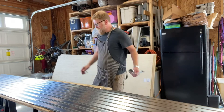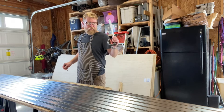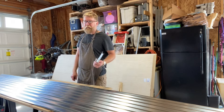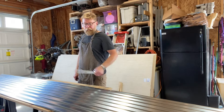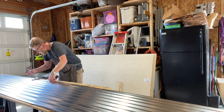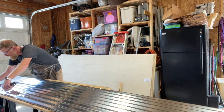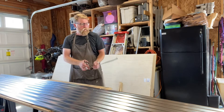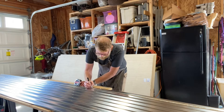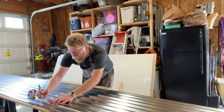Since this is a 12-foot section, we want four-foot sections. That works out really well because this is technically just slightly above 12 feet, so that gives us a little leeway — when cutting with the shears it probably takes somewhere between an eighth and a quarter inch width of material. So that actually works out really well. I'm going to measure four feet and put the mark just on the start of the rise of the corrugation on both sides, doing it even four foot, four foot, four foot. I'll measure this side too — from doing this earlier this morning I know it works out really well.